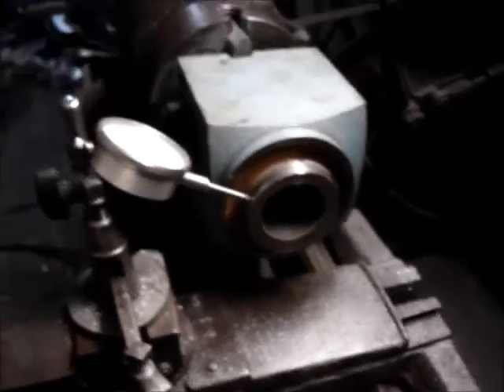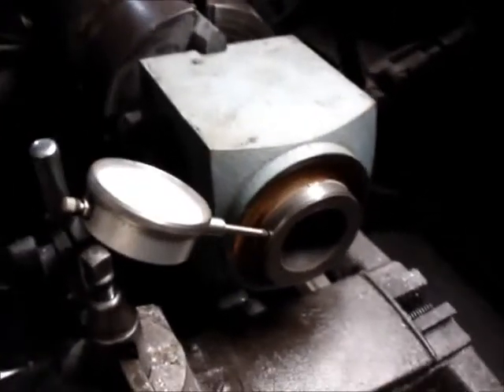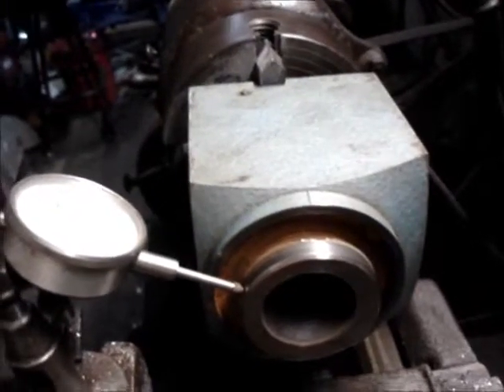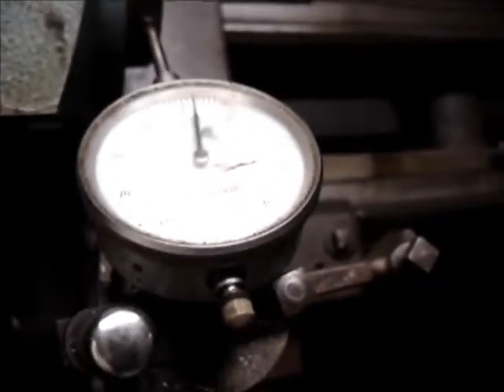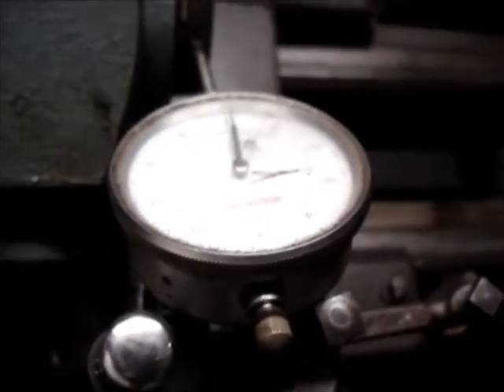How you doing folks. I took a video on this little milling machine a while ago. What I'm using here is a dial indicator, and that's for when you want to get your piece right in there centered in the chuck. You can see I'm just about there — if I can trust this indicator, I am within about three and a half thousandths, which is really damn close.